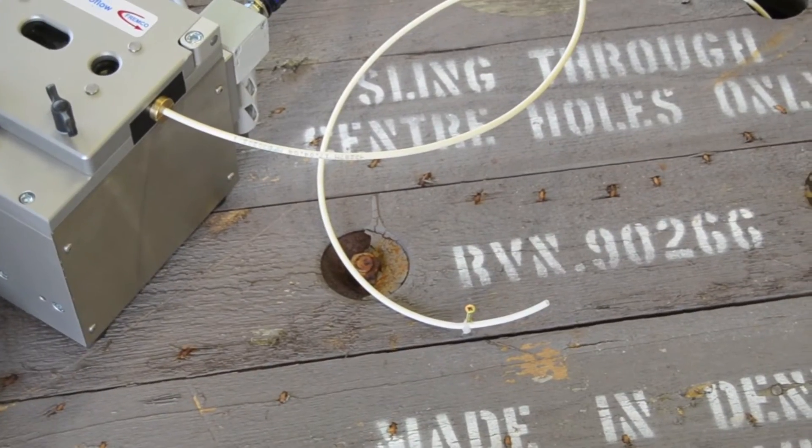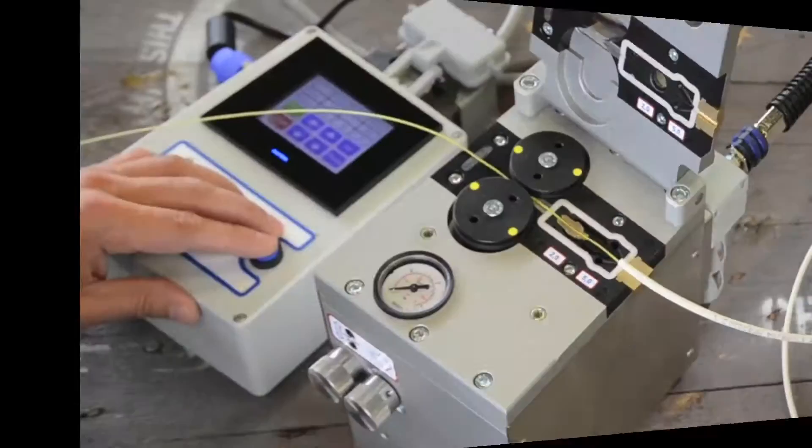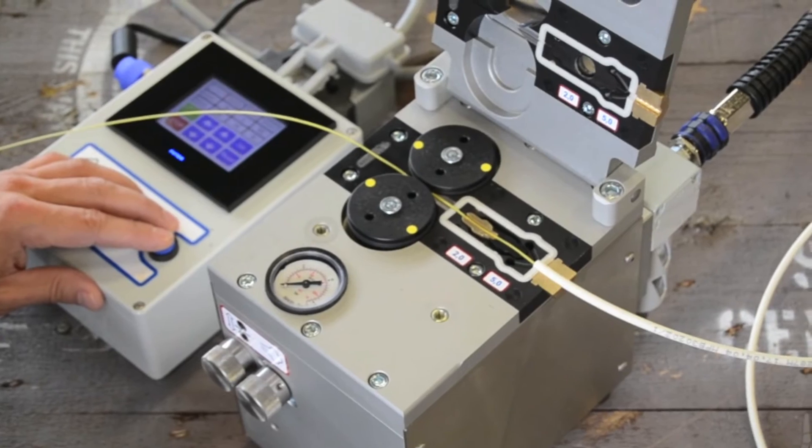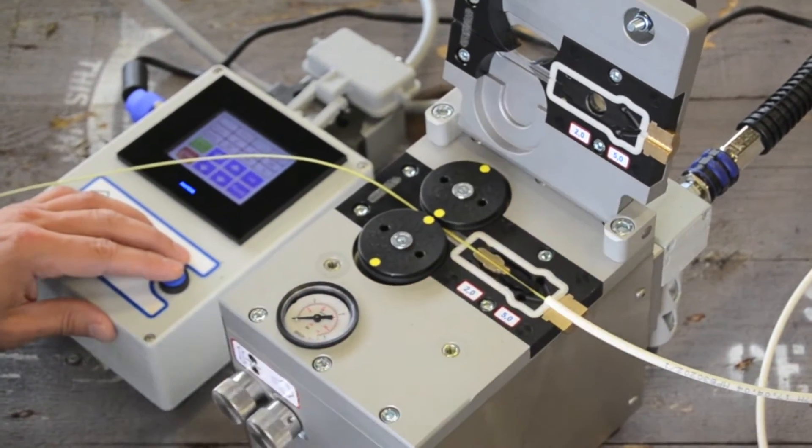In this demonstration we are going 85 meters per minute and the fiber is quickly through the micro-duct. If the fiber cable meets resistance during the job, it could be a connector who is damaged or a squeezed micro-duct.